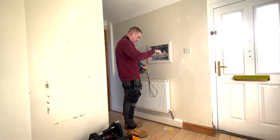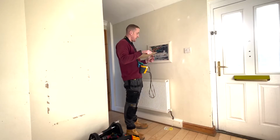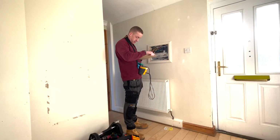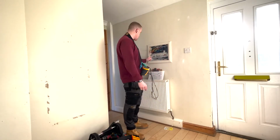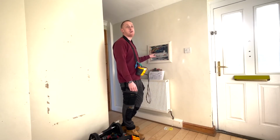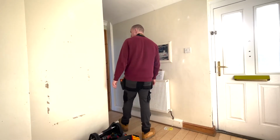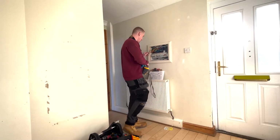So that one was 0.62. That's the highest I look, because for both of them, on the same circuit, well, same MCB, I'm going to put them on the highest reading, 0.6. Oh, sorry, it's 0.68. Put that one there. Slow it down. 0.68. However, that is all the sockets. So what's that one doing? What's that extra one doing there? That's every socket on the full place. I'm going to have to disconnect that one until I find out what it's for.